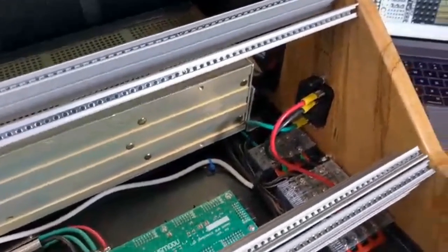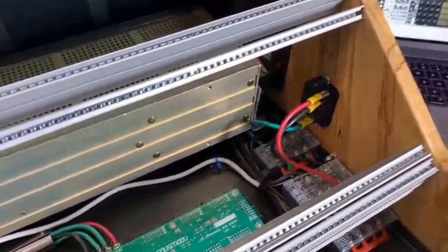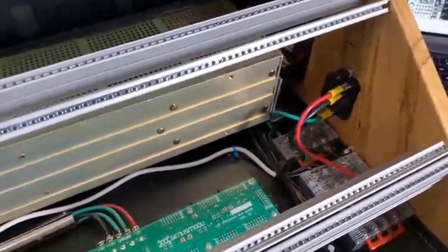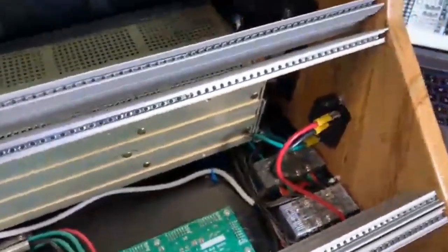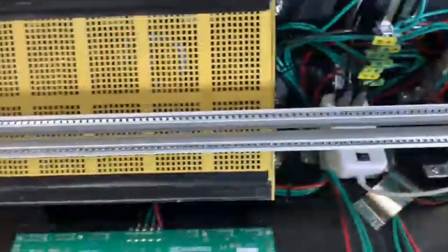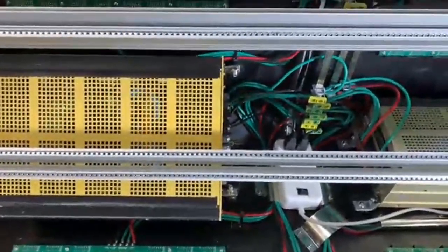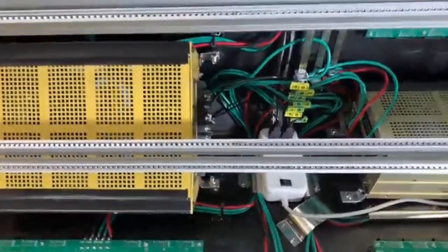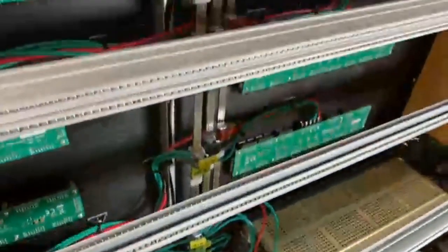And that's not the stock configuration of virtually any modular case. So that's something really worth doing, is making sure you've run a ground somehow from your case to your mains. That'll reduce the noise level right there. I've seen it done before, and it makes sense, but I've also seen people just mention that there's no need to actually wire anything to the rails at all. That's come up a few times. But you're saying the opposite has been true in practice.